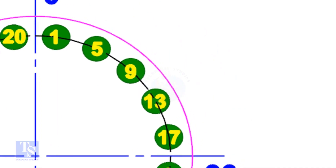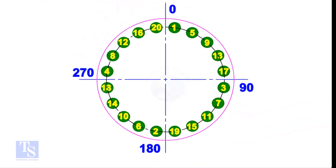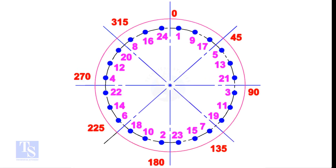See any quarter of the circle — the difference between any two adjacent numbers is 4. Check the next quarter. Now you don't have to refer to any documents for bolt tightening; you can do it with simple calculations. For larger flanges, divide the bolts into 8 equal groups and apply the same method — the difference between the two nearest holes will be 8.